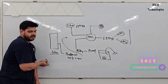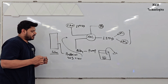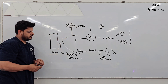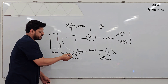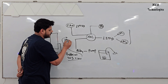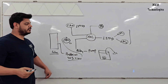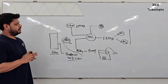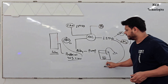Then we have solar panels. The solar panel is giving power to the batteries, and these batteries supply power to the modules. For that, the 12 volt battery potential is used, and then we have a 7805 module which will give 5 volts to each module, because some modules require 5 volts. That is why we need the 7805 module. And 12 volts will be given directly to the L293D motor driver.